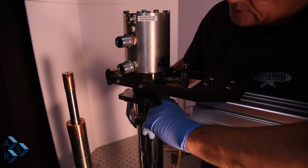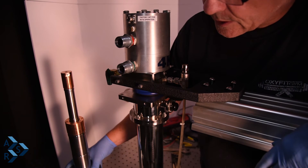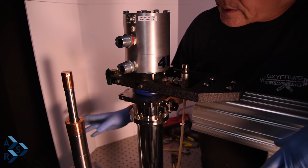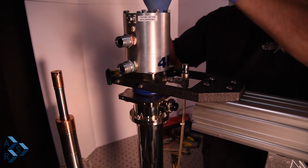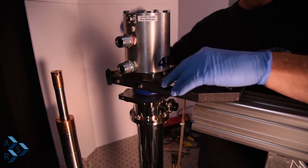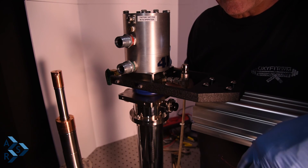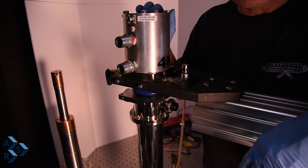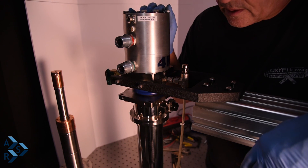You can disconnect the bellows, pull the whole head out, and send it back for repair. If you have another cryostat, you can put it right back in and continue testing. We also sell maintenance kits — with proper training you can remove the bolts, pull the motor out, pull out your displacer, put the displacer back in with the shipping spacers. We have training at our facility for people interested in cryostat maintenance — check our website and call our service department to set something up. That concludes our discussion of mounting a DMX20OM to an air table. Thanks for watching.